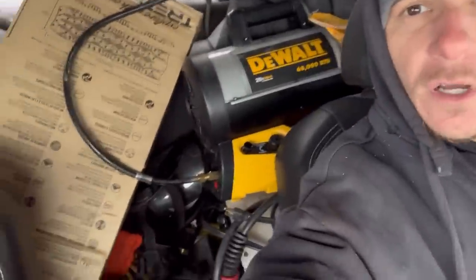So today our task is we're going to plate over the existing frame steel, which is only 16 gauge. We're going to be using 3/16. We're going to be using flux core. I got my little flux core Hobart back there. You can't really see it right now. I brought my cordless DeWalt bullet heater, which I fucking love because it runs on battery. We're gonna try to heat this storage unit up. He's got a pretty big one, plenty of room for me to work. And we're gonna see if we can't work our magic and get this man back in business.